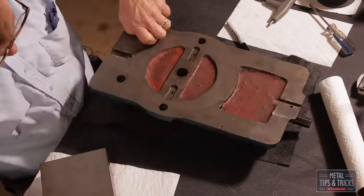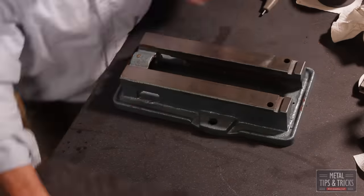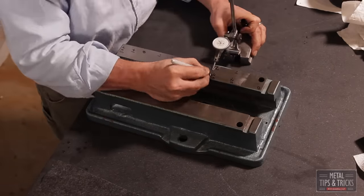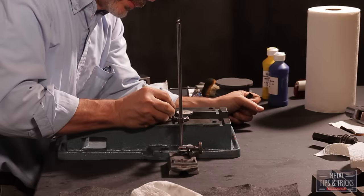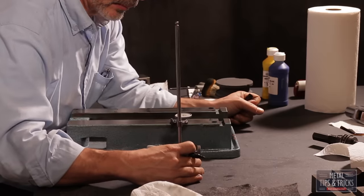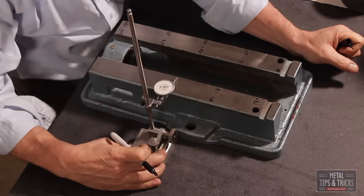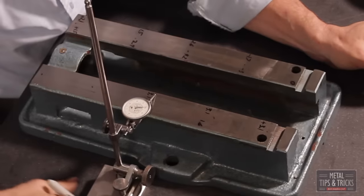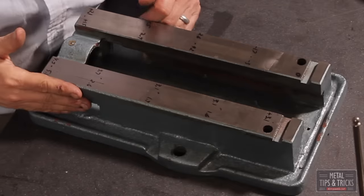So let's go into the regrinding of this vice. I'm going to take the whole thing apart and measure it — see where it's at, see how flat the bed is. The numbers here are all over the place. Even from one side of the rail to the other, the numbers are just a mess. What that tells me is the cast iron was not cured correctly and the stresses were not relieved before it was ground — they cast it, ground it, put it in a box and shipped it out.